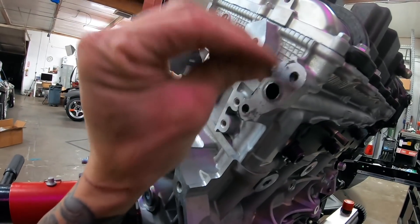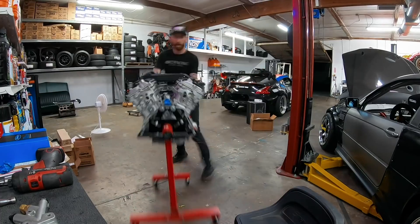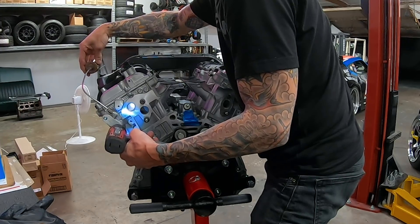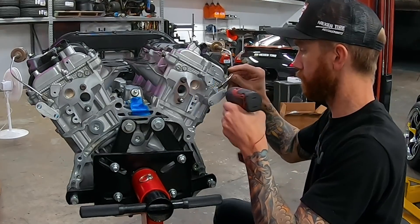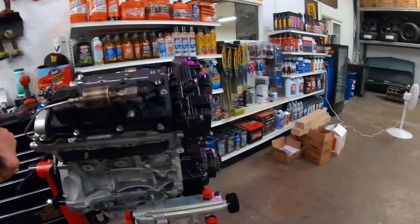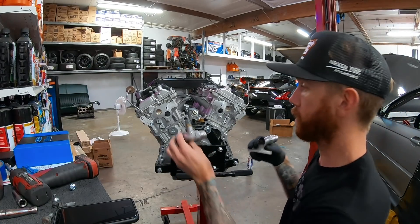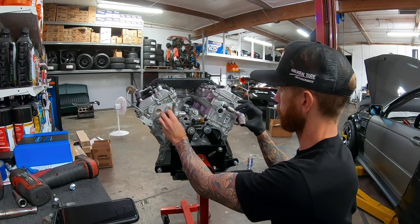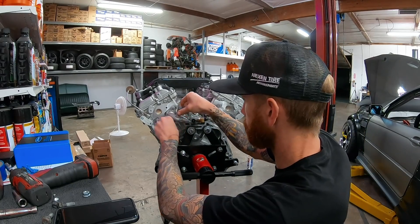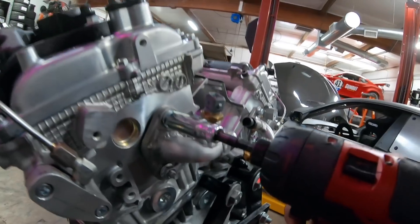A razor blade is great for cleaning this stuff. These are actually plumbed right in the head, which is really cool. We've got a little port, little canisters, little dampener, and then the pressure sensor right on the front there. We're going to glue on our little water outlets - this one has a water temp sensor on this head, this one has a water pressure sensor coming out of this head.